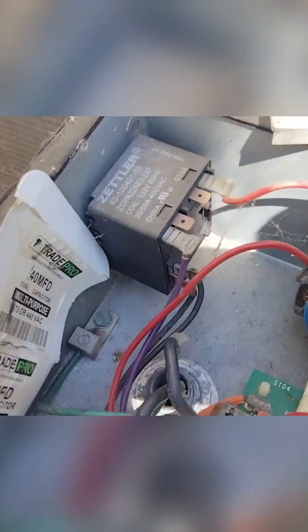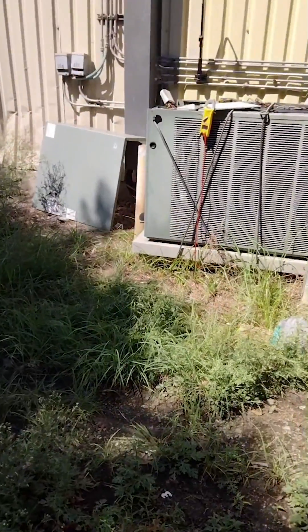From our main disconnect we follow that whip all the way in — we can see the main power is coming in right here. Another obvious way to tell, for those of you that have boards like this, is to look at the gauge of wire. You can see at these terminals there are two very large gauge copper stranded wires. That's generally how you know — it's going to be huge, usually six or eight gauge wire. That's definitely going to be where your disconnect main power is coming in through the house or through the disconnect.